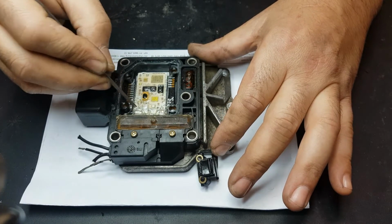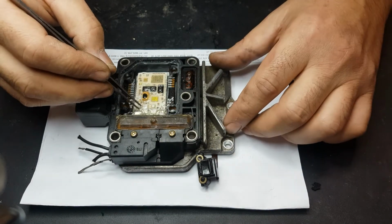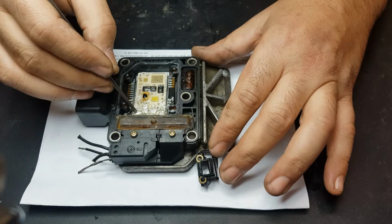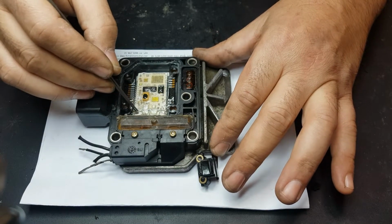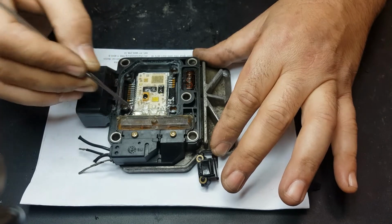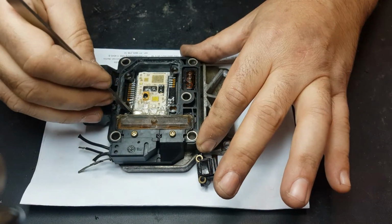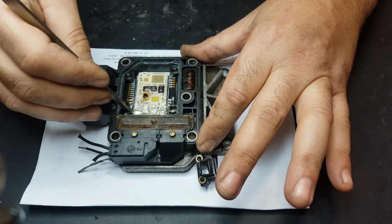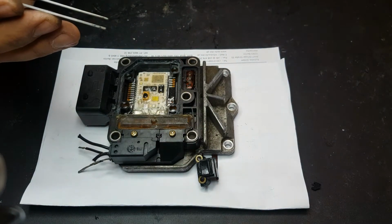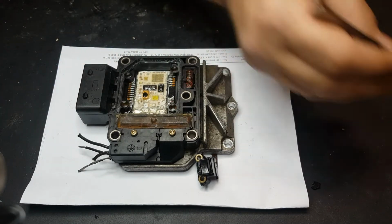We are going to remove all of this. We don't need it anymore. The other thing about these Bosch VP pumps is that all of this is aluminum, and it's not the easiest thing to solder. So we have to get a special acid so that you can solder copper to aluminum. I'll show you in a bit. The product that I use works really well.